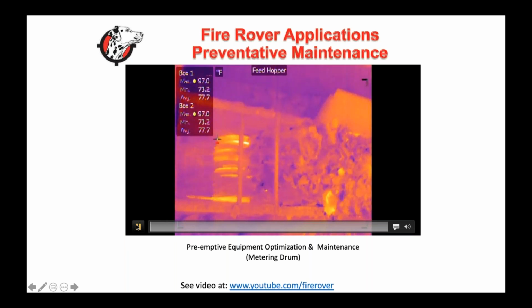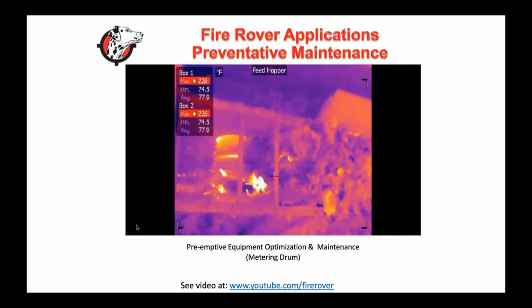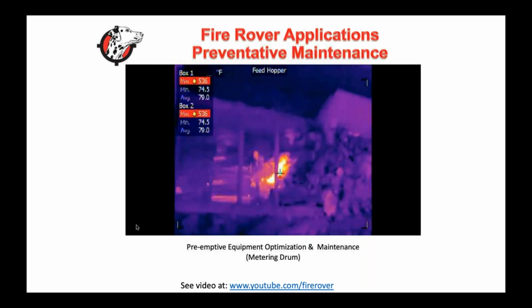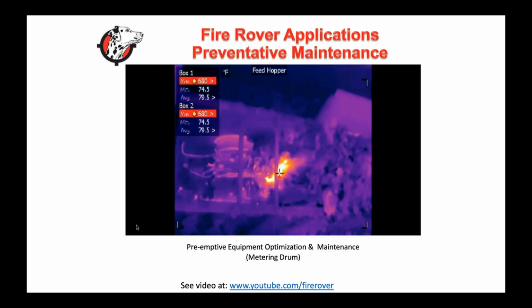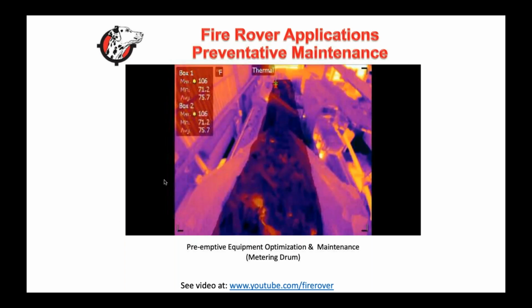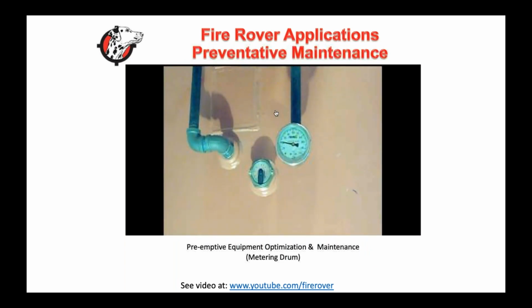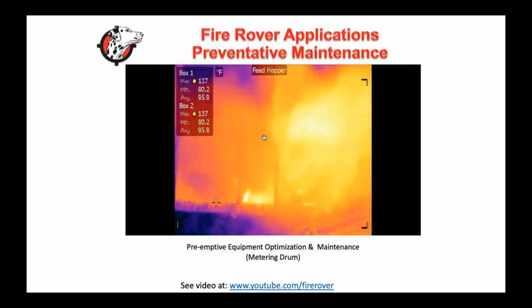This is actually preventative maintenance, so I think this is an important one to show. When you were talking about whether there is heat at one specific point versus looking at a macro view of an area, how much heat is actually happening across the board? Here, we have a thermal camera strategically located over the infeed. When there's a fire, we shut down all conveyors in this operation, and we do this for a number of our MRFs and transfer stations. The idea is that when we see this, we can go and fight the fire, but most importantly, the fire is not moving.